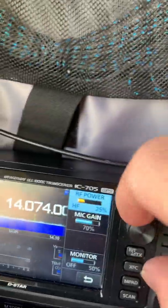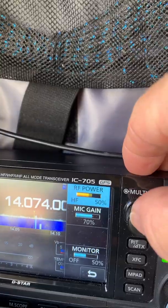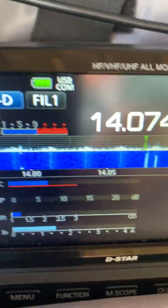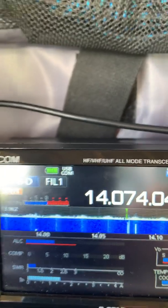And we'll raise the power back up all the way — which in this case is 5 watts because I'm running off the internal battery. And I'll just click tune again and watch the SWR, and you can see there it is. Just a hair of SWR. About 1.2 to 1.3-ish. Just putting out the full 5 watts and working well.